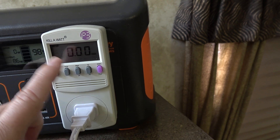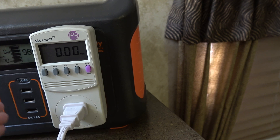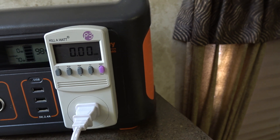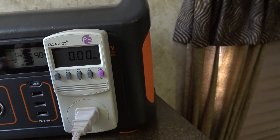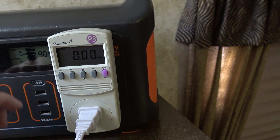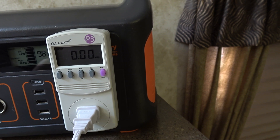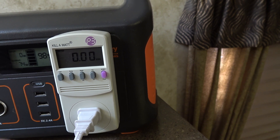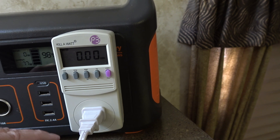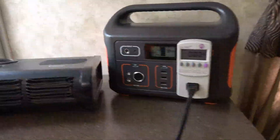That's where it comes in handy for figuring out your off-grid system. You can plug different items in, run them for the time you'd normally use them in a day, and slowly add up how many kilowatt-hours you're going to use per day. Then you can use some math and calculations to figure out the amount of batteries you're going to need and how much you'll have to recharge every day — whether that's with solar power or figuring out how many hours to run your generator.